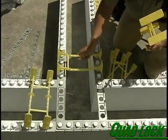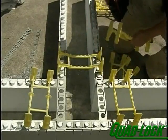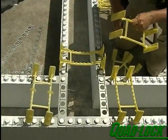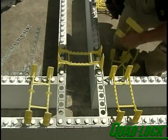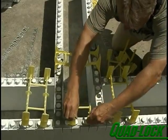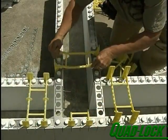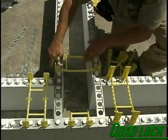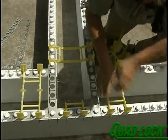Place a full tie on either side of the T-leg as close to the T-leg as possible. Cut tie flanges and place between full ties at the center of the T. Place a full tie in the corner bracket at the top of the T-leg. Repeat this pattern on every row up the T-wall.